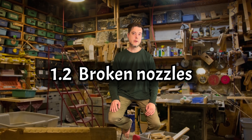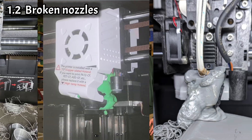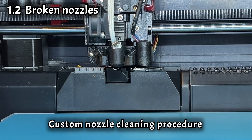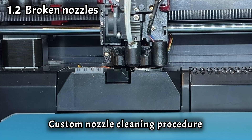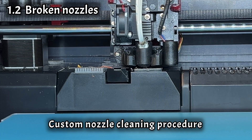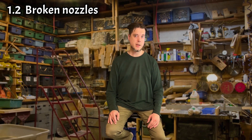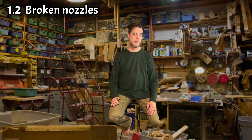Another common issue with the Plus 4 is a broken, cracked, or bent $15 to $60 nozzle. This is caused by the nozzle cleanup mechanism and the whole rear wall of the print chamber being built with much too large tolerances. The nozzle can grab into the poop chute, scraper, or the cooling PEI plate, and the stepper motors are easily strong enough to crack and bend the nozzle — which may already be under tension from a misalignment in the hotend. Since the reason can be either the scraper or the PEI sheet, the solution has a few approaches.